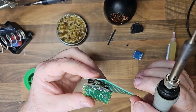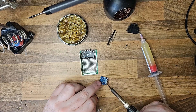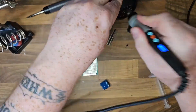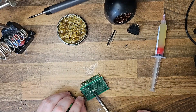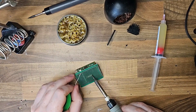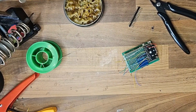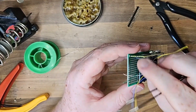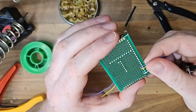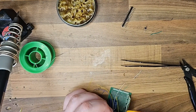Next is the SD card reader, which is pretty much the same process. One thing I've done is put electrical tape on the metal parts that will be touching the breadboard, just to avoid any shorts. Once I've put the standoffs through the SD card, I tack it in place through the other side of the breadboard, then cut down the legs because they were a bit too long. I've now attached wires to the DVI breakout board — it's going to be a bit of a spaghetti junction again, but I just want this to work. I'm running the wires through the Pico and through the breadboard.